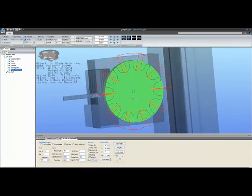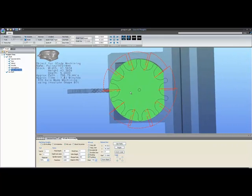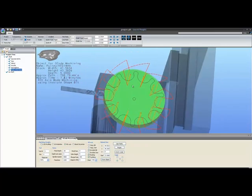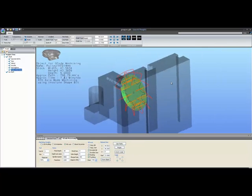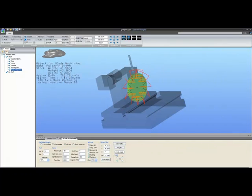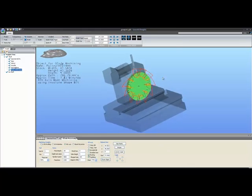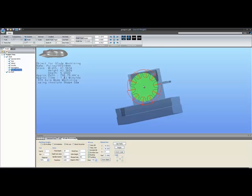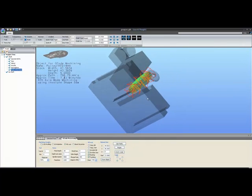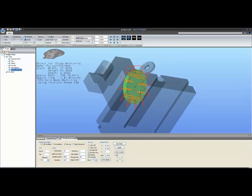Your responsibility, however, would be to make a cutter, which is the shape of one tooth of this pulley. That tooth shape is put out in the DXFs, so you can use the information from the DXFs to make those shapes so that you can get a very nice, easy fly cutting operation done. And again, if you have a saw type or slit saw type cutter holder, you could go to this and do the exact same thing from the side on your particular system. Again, remember to tell the system which way you're actually facing with your fourth axis.